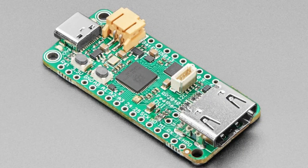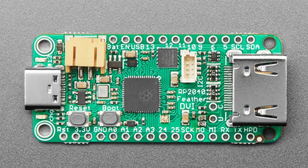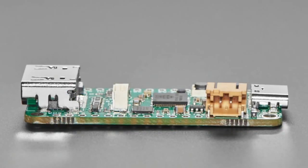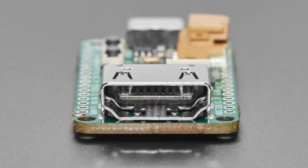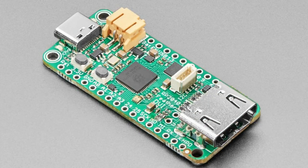It's a 320x240 or 400x240 internal frame buffer with 16-bit color. The RP2040 only has 264K of RAM, so 320x240 uses about 155K and 400x240 uses about 190K — you want some memory left over. There are PicoDVI projects where you can generate graphics on the fly for higher resolutions, but then you don't have a frame buffer.